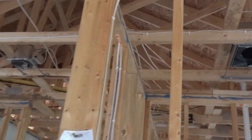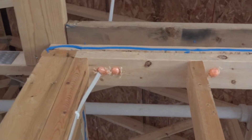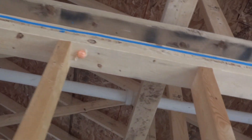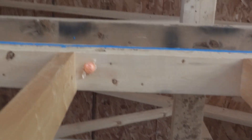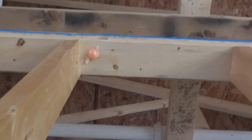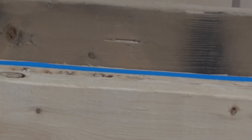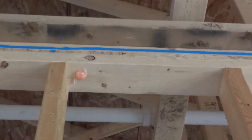As we mentioned before in one of our previous videos, we'd gotten in and sealed up all those penetrations going into the attic. This EcoSeal acts as a gasket — if you zoom up you can see how it sticks out just a little bit beyond the stud. What that's designed to do is, when the drywall goes up against that EcoSeal, it's going to seal that up by forming a gasket and stop that stack effect from occurring, making the house a lot more comfortable and energy efficient.